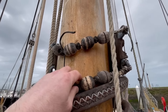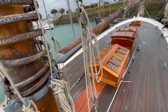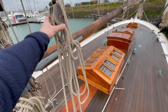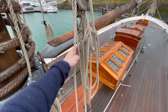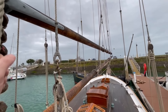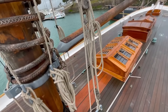And then we've got a pair of blocks here. So the halyard falls come down. This is the peak stretcher — you've got a five-to-one purchase on that. And this is the main peak, so you can take it up as far as you can, and then the last bit you can use the stretcher for if needed. And then the throat is on the other side, on the starboard side.